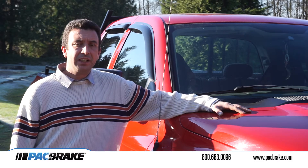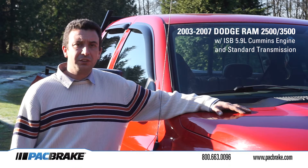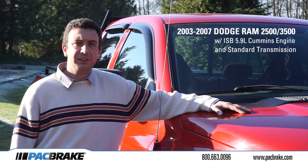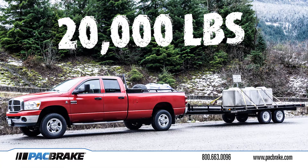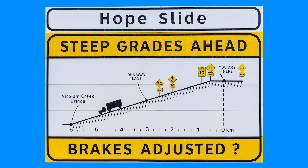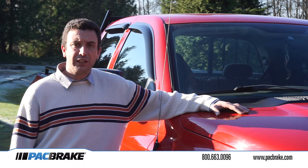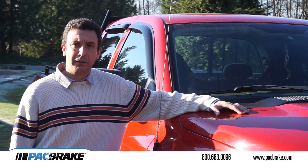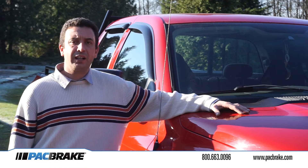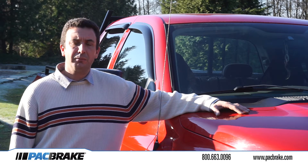The P59 applications are as follows: the 2003-2007 Dodge with Cummins ISB engines and standard transmission. Today we are going to load up this truck with 20,000 pounds and take it up to the Hope Slide. We will do a descent on a 7% grade — one test with no exhaust brakes, then a repeat with the exhaust brake PRXB only, and a third test with the Load Leash and the PRXB working in combination.